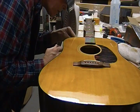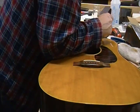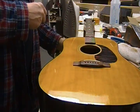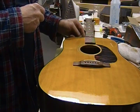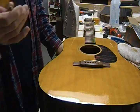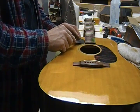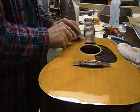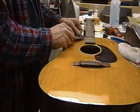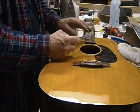It's hard to tell if the neck joint — it looks like there could be a slight roll — but it would be my guess that they didn't finish these instruments together. So they finished the neck, finished the body, put them together. They might come back and do just a slight touch up around the neck with a little lacquer, but they sure didn't puddle it in there. So all I did when I was prepping for this was just took the knife and basically pushed the edge right around here, all the way around it, down the side of the heel and across the back, the bottom at the very tip — just pressed it — just to make sure there wasn't anything that was going to hang me up when I got to this point.